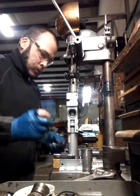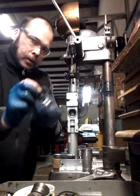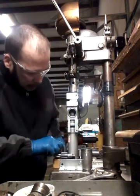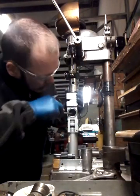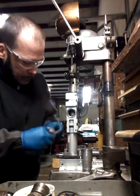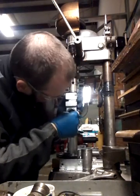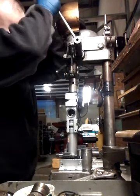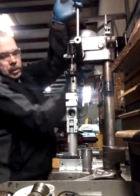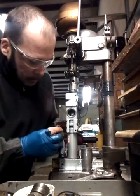We got a spacer washer that just fits right on the end of that gland fitting, right in there. I'm gonna put her in there, and if that piston's twisted slightly, we're gonna untwist it with a screwdriver, and we're putting our washer in there, just backing off this piston just slightly, always being very cautious because it is under spring tension and it'll chop your damn finger off. So alright, so we're gonna line this up.